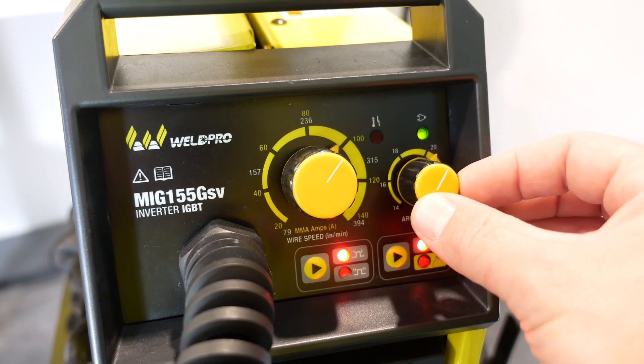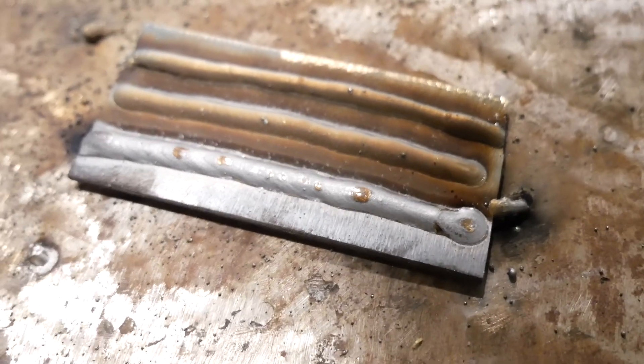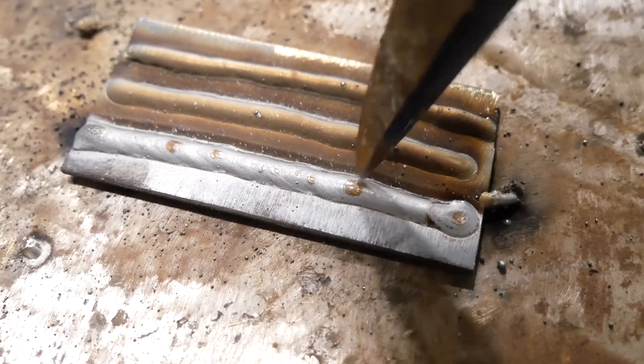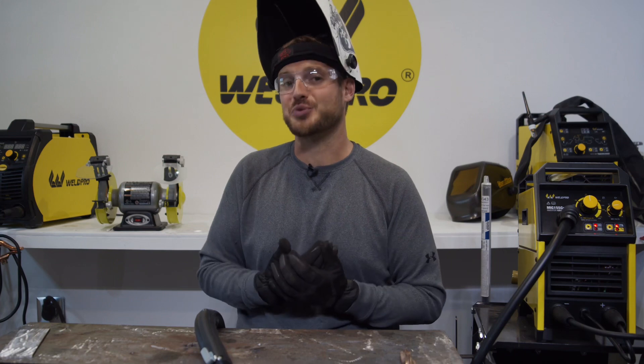Let's go ahead and turn up the settings one more time to a little over 20 volts and about 315 wire speed. The third pass is laying in very nicely — it's running nice and hot and getting good penetration. It's easy to move quickly with a setting like this. This third pass turned out low and flat. On the top of this weld there are a few silicate deposits; these can be chipped off with a chipping hammer. Solid wire is really nice — it comes out with a great bead appearance and can run very smoothly. Take your time and repeat these welds, and get that muscle memory down of your gun angle and your standoff distance between the nozzle and the plate.